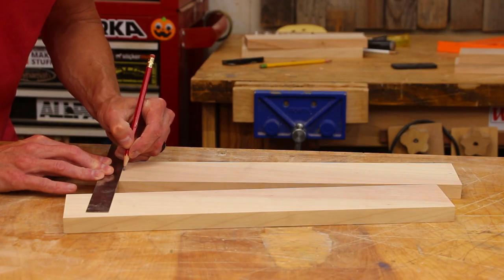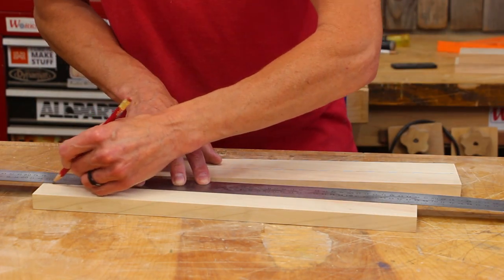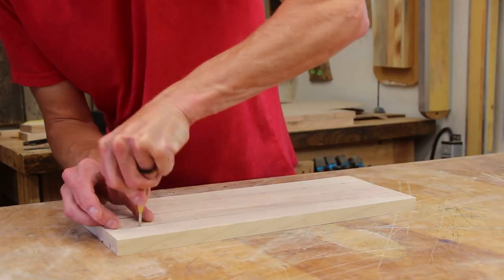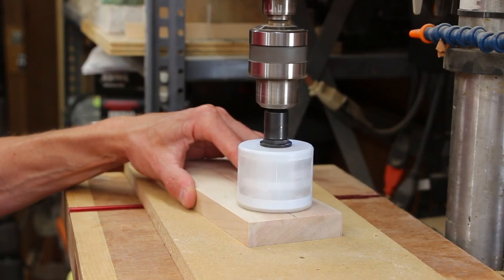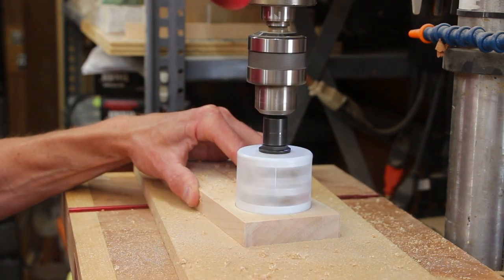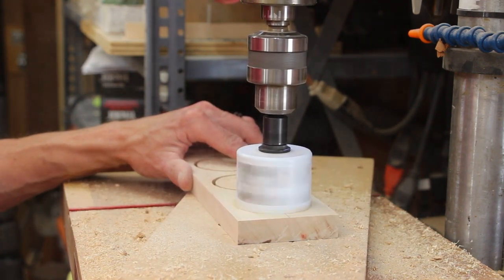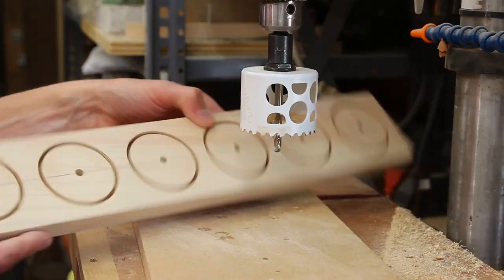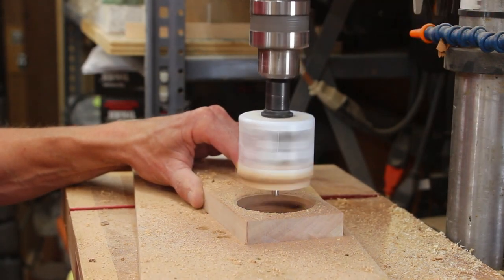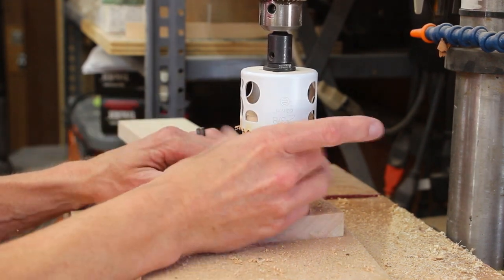We need to lay out a center line, mark out and drill some holes in here which is going to allow us to slide the PVC pipe into these holes. I'll use a two and three eighths inch hole saw to drill part way through this board on my marks — I'm not going to drill all the way through just yet. Once I've drilled part way through all of the holes I'll flip the piece over and then using the same pilot hole created by the hole saw, I'll finish drilling all the holes to cut out the center. By cutting it in two steps like this it's going to all but eliminate the tear out.